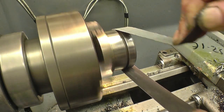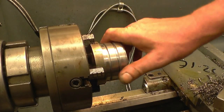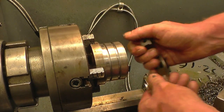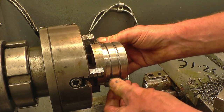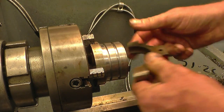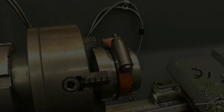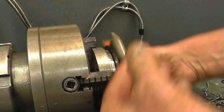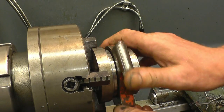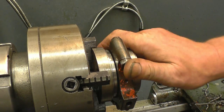I think it's alright. Once I've polished this up — that one was too slack, so I've made another one with enough metal, and that's going to be much better, a much tighter fit. I'll clamp it around to see what sort of fit that is, but it definitely feels better. Those two bolts are now fully tightened and that really is a nice fit on there. It's got a little bit of end float that way, which is what you need, and it really is a nice tight fit. By the time that's run for a little while, it'll be just about perfect.